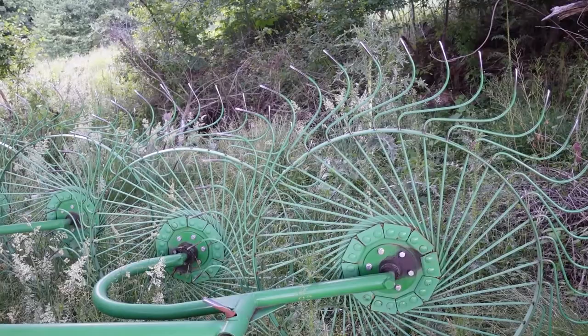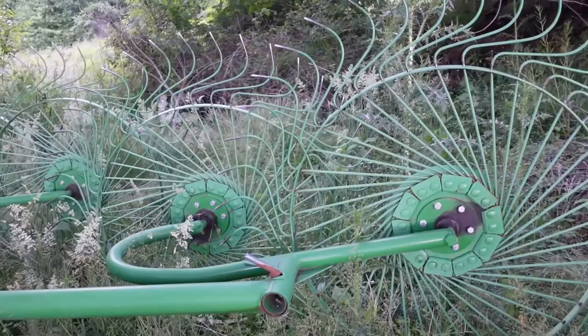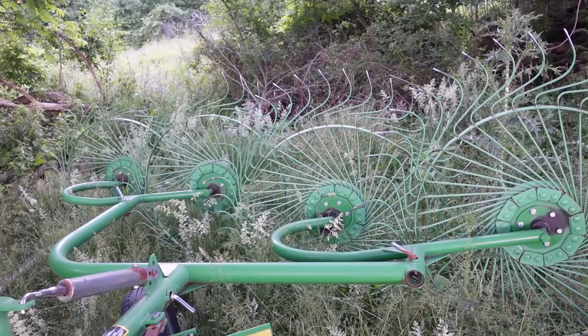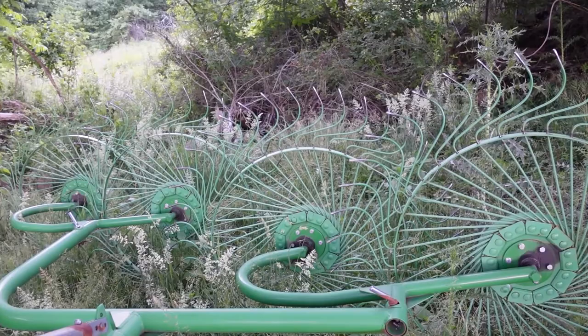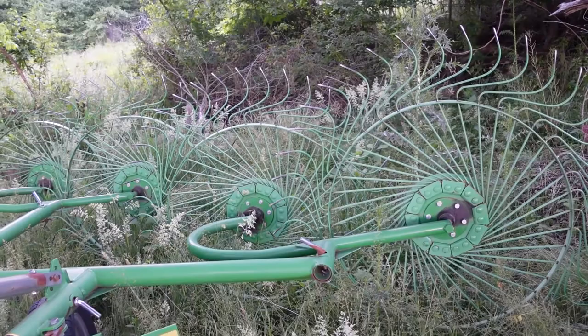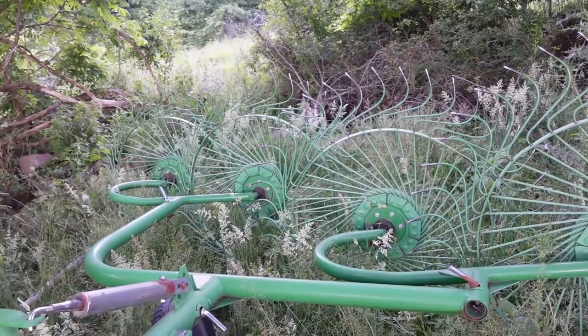You can see the wheels are pretty cool. There are little metal fingers on them — you might be able to replace individual ones, but a lot of times it's almost cheaper to replace the whole wheel. I haven't broken them badly enough to have to replace them, though I have hooked some fences. This rake has several grease points, and I always grease it at the end of the season so I'm ready for the next one. I'll probably grease it later this week in case we get a second cutting — though on our farm we don't always get one.